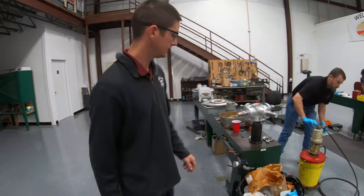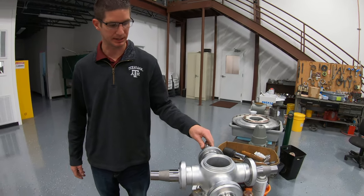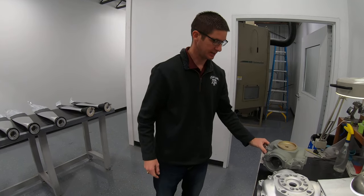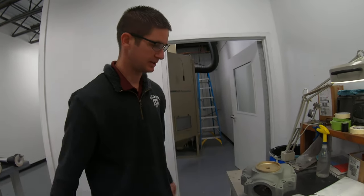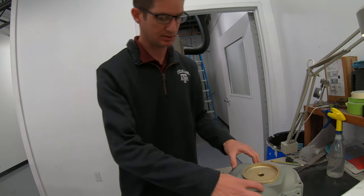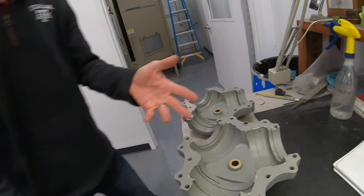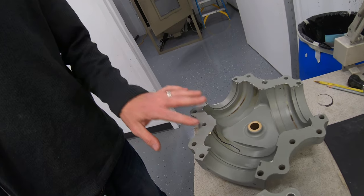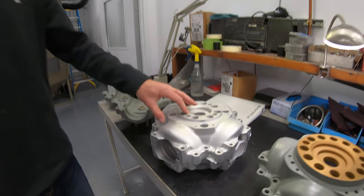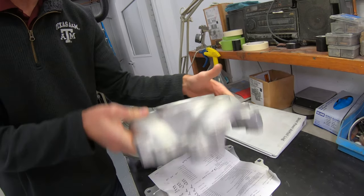Let's talk hub overhauls. This is a four-bladed steel hub for a King Air 100 propeller. This is what it looks like before you put blades in it — it's got brand new cadmium plating, everything is real nice and shiny and new, and all of your mounting hardware is factory new parts. Just like blades, hubs have to be overhauled as well. So this is an example of what a hub would look like fresh after disassembly — it still has paint on it, it still has the Alodine corrosion protection coating. From here it'll have to go to the blast cabinet just like you saw for the blades, that paint has to be blasted off. From there it goes through the same chemical line. This is what one would look like after it's been chemically stripped, and you'll see that most of the corrosion has been worked out.